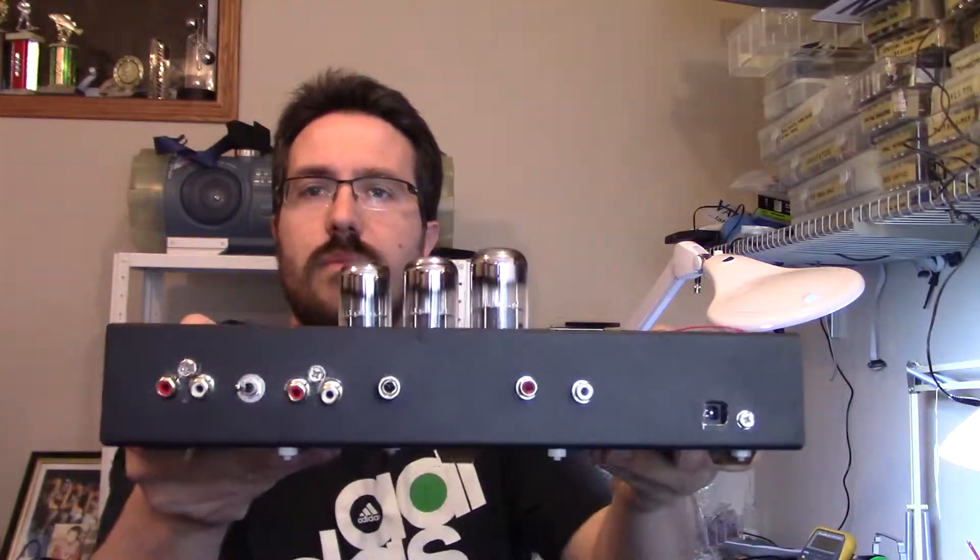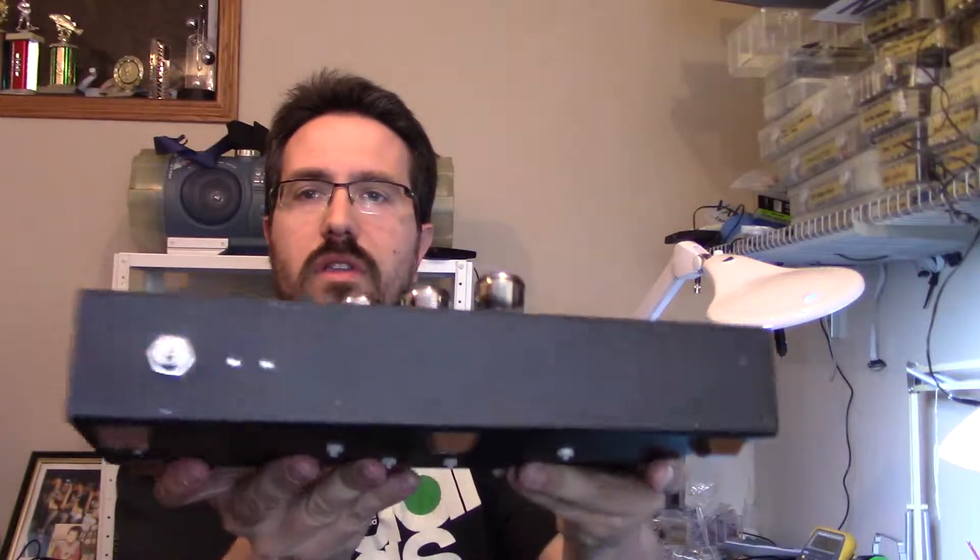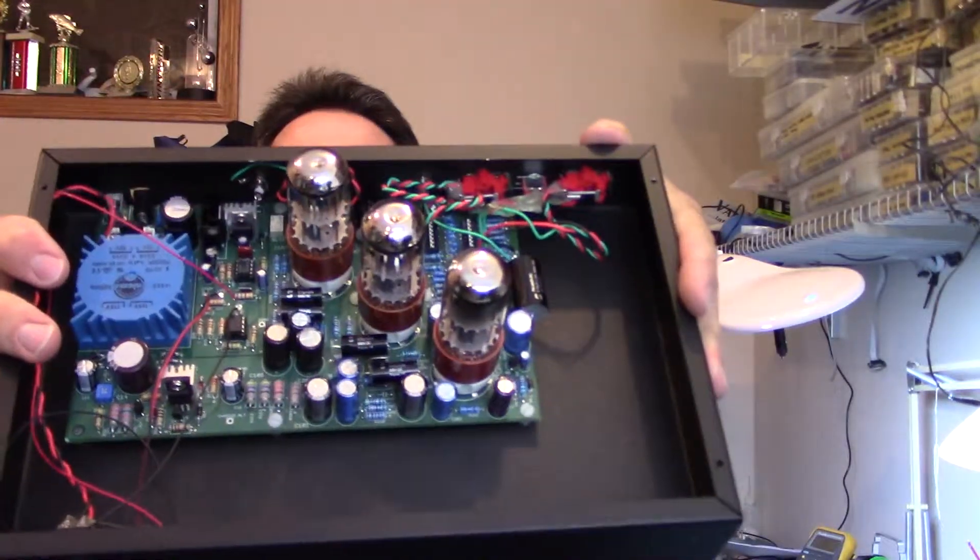Assembly's all done — that's what we ended up with. Next step is to power it up, adjust the voltages with the trims, and test the moving magnet and moving coil inputs to make sure we're getting signal at the output. Lastly, we're going to hook it up and hear how it sounds. See you next time.